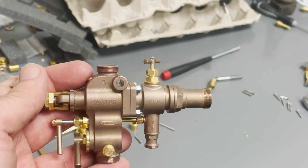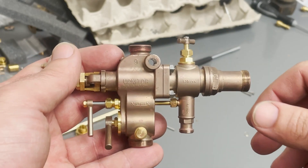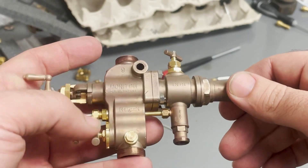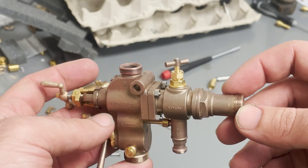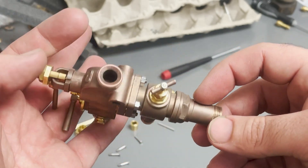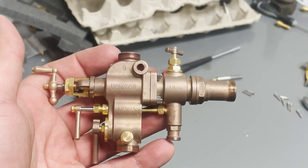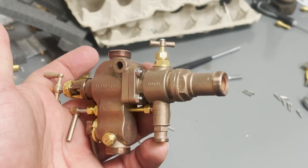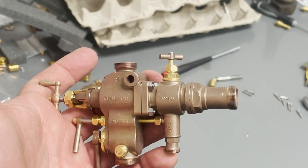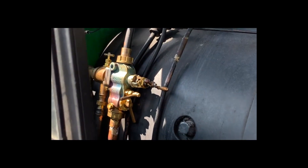To be honest, I was hoping there would be something wrong with it so I could go into more detail on what I'm looking for in my thought process during troubleshooting. But it worked great — from 35 psi all the way up to 145 psi, and based on how it did at 145 psi it should easily go up to 160 psi. Maybe in the future we'll get something in that actually has a problem we can investigate. Until next time, thank you for watching. If you want to see a video on how the monitor injectors operate, there's a link in the description below.